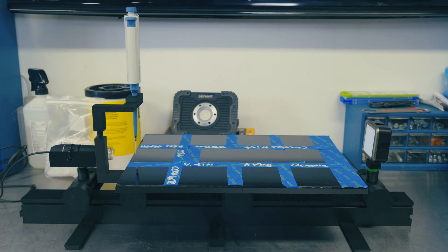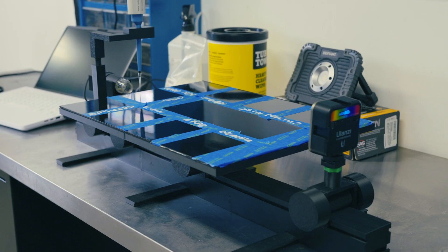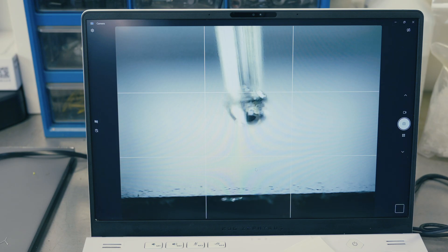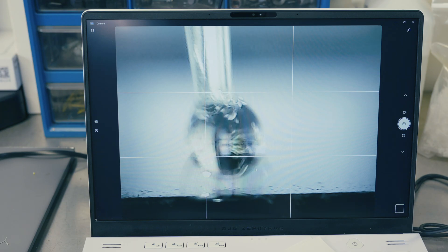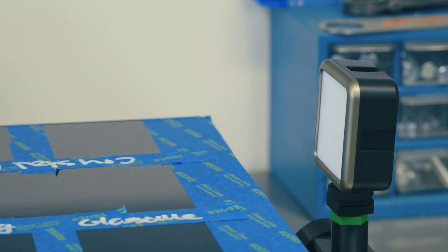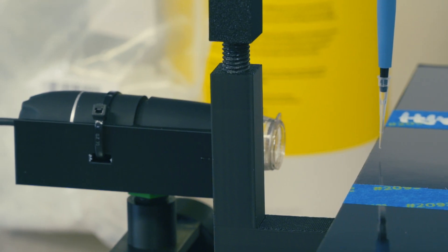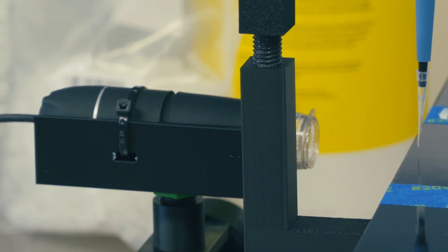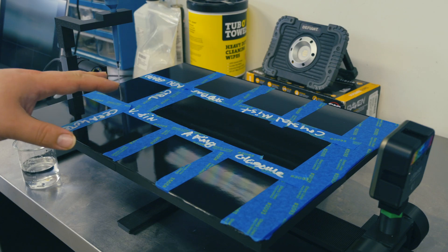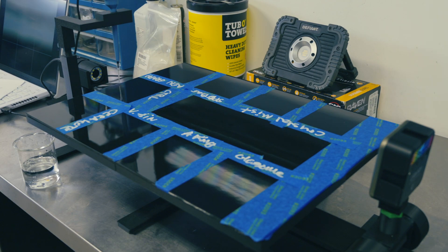This is not some kind of lunar lander. It is my brand new optical contact angle meter, the tool that will allow us to perform our new tests. In essence, a small drop of deionized water will be placed onto the panel via this micropipette. A small rechargeable LED panel at the back provides diffused lighting to help create contrast. This microscope at the front focuses on the drop of water and passes the image to my laptop. We've got our test plate here — you can see the different products we'll be testing today, and we have our control.